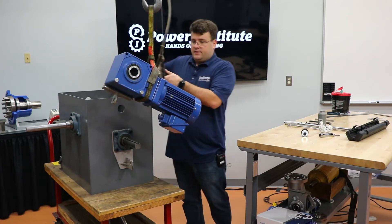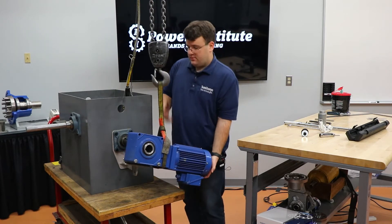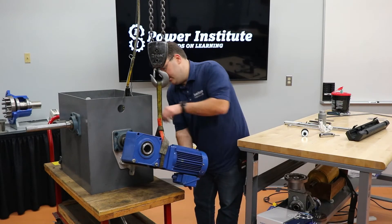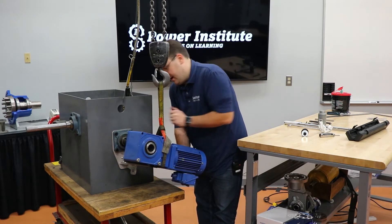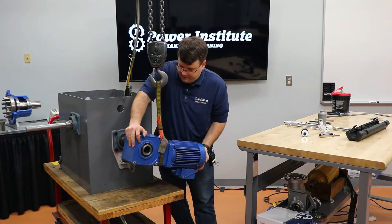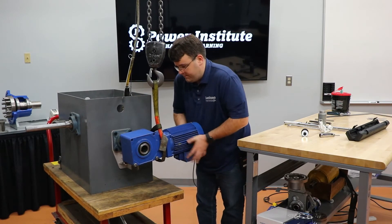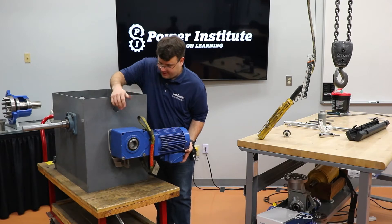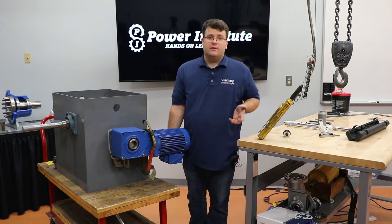We'll go ahead and drop it down and get it on the shaft. We get it as close as we can with the crane — these aren't that heavy, but for ease of the video we're using the crane. Once we get it close, you line up your keyway and bore to the keyway and key stock that's in the shaft, and you're going to slide it all the way on. There is a little bit of a trick — you kind of have to wobble it on to get it to walk all the way down. If you have to, lift it up a little while you're pushing in, rock it back and forth, slide it in, and get it as far in as it'll go up against the collar in the back, up against the shaft collar. Then next is the torque arm hardware.